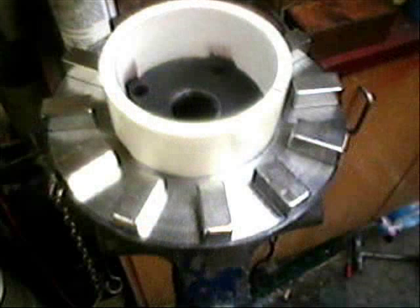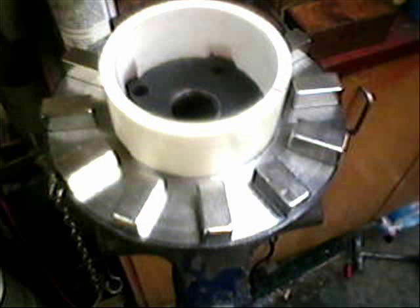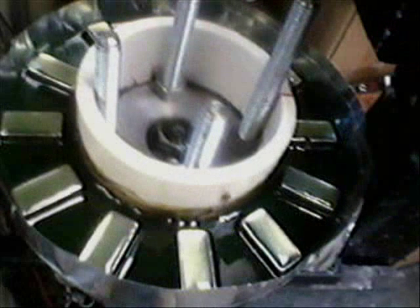And a better shot showing the back side of the magnet rotor — if you look around the outside of this disc, there's an eighth-inch lip that's painted black. The magnets are all butted up against that. In the center is my center mold. If you look on the inside, you'll see four places that have been rasped out with a square rasp to make room for the flat sides of each of the nuts — that lines it up perfect. I just poured this one; you can see the aluminum foil tape around the outside and the center mold and how it sits. And the second magnet rotor after everything is removed.